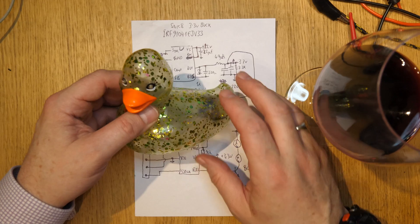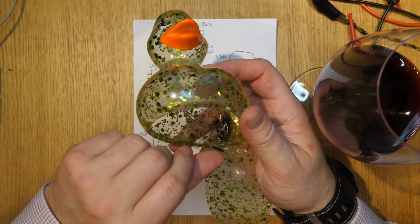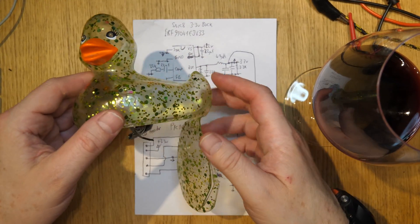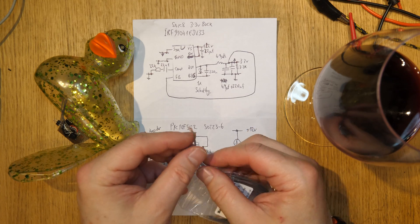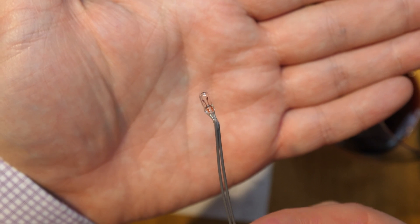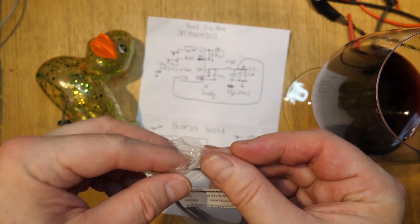So, what's inside little ducky? Let's have a little look-see. Inside what we have is a little board, and you'll see here that there's some grey wires going off up into the yonder, which is where the eyes are. Those are these little six-volt incandescent bulbs. Those are the incandescent bulbs, six-volt jobs, put in series, so that's 12 volts.